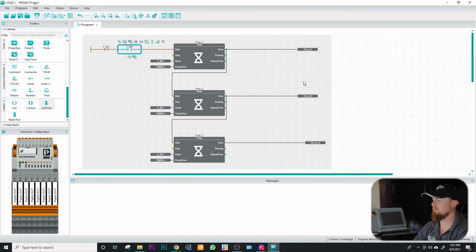It's literally that simple. Just make sure you have your driver, and also make sure that you're using the proper programming cable, because some USB cables are just power cables and they're not data cables. Keep that in mind, because if you're using the wrong cable, it's not going to connect. It may even give power and look like it's connected, but it will not actually be able to communicate or even show up at all. So just keep that in mind.